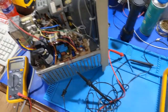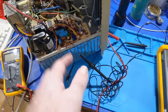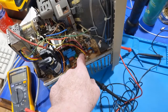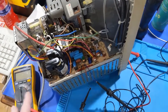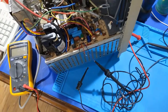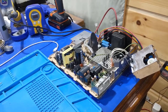So yep, something is clearly wrong here, and I'm going to probably grab the board that I own that works and run the same tests, because I don't have a data sheet and I need a way to get data points. And this, we know there's a 24 volt input, 19 volt on the zeners, a roughly 20 volt on the drive transistor, and 74, 75 volts for the rest of the system. So we have that, and the video is the documentation of that. So now I want to grab a working board and I want to run similar tests. I want to see where things are. I want to remove the transistor and do the same thing with it and see where we are with that board. This one works, so I'm just going to remove the transistor out of that one and use this as a frame of reference for what voltages need to be and etc.